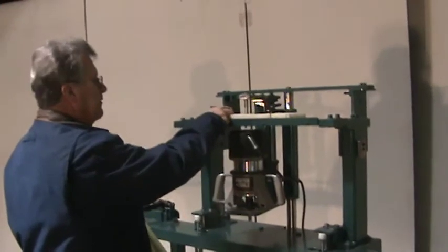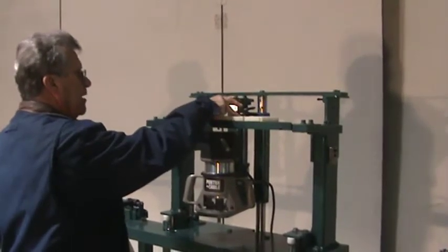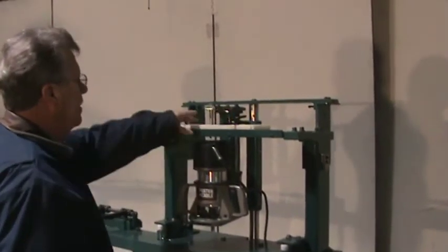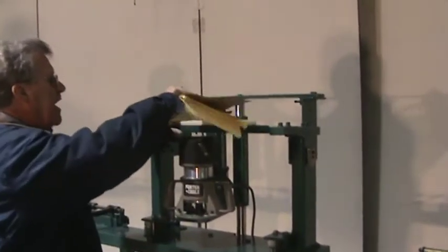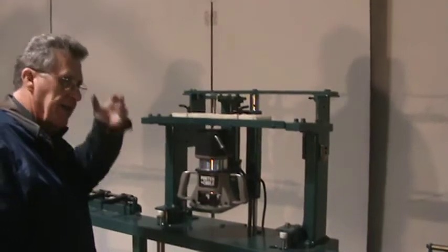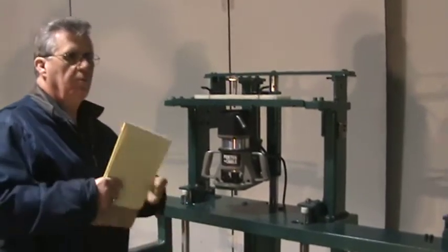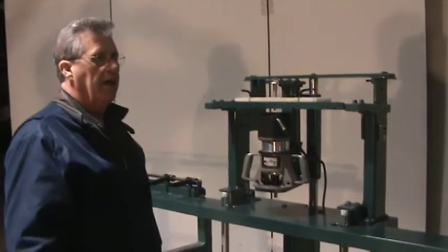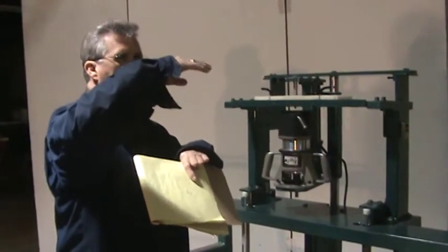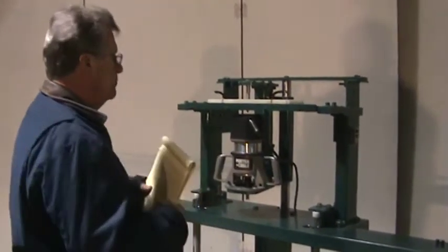You can get these templates at 5.5 on center. You can get them just standard where they're just one position, T strikes, anything you want. We have made them where these are on 8-inch centers, and that was for a customer that wanted 8-inch centers for his 8-foot jambs with a longer door. It helped to have a full eight inches up to put the deadbolt. It helped make the door more rigid and not warp as much.